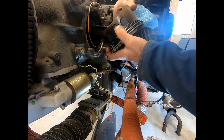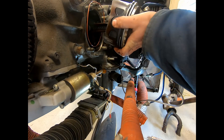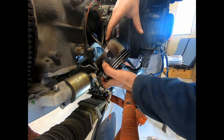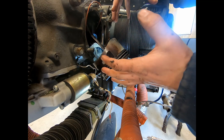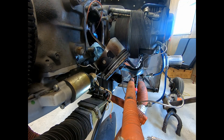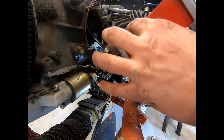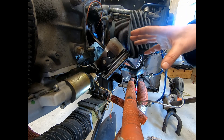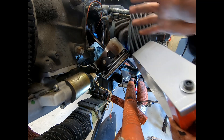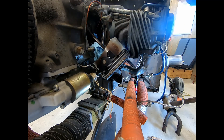This piston pin is seriously stuck. One of two things will help with that: either an electric heat gun — you really heat the piston up, get a little bit of lubricant in there to push them out. Sometimes that's all you can do because of the space available. Or this tool is pretty fantastic for pushing that piston pin out. The only problem is sometimes there isn't room if you're not dismantling the complete engine — for example, if this was a six cylinder and you were removing only the middle cylinder, that doesn't fit in. An electric heat gun will work very well in that case.